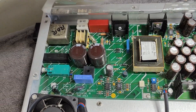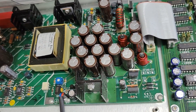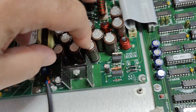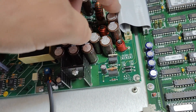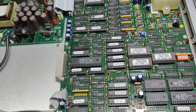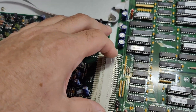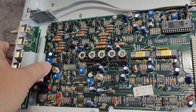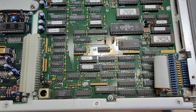I'm absolutely impressed - look at all those capacitors. I believe we've got some after-regulation stages here to smooth out everything from the switch mode. The capacitors, filters, and then after-regulators provide nice clean DC that goes to all this digital stuff, but also some of the voltages go down to all the analog output stages that generate the TV images.